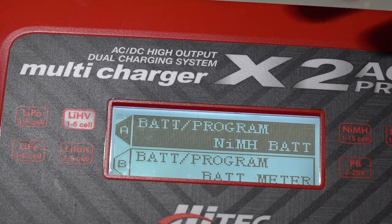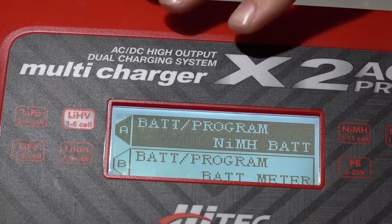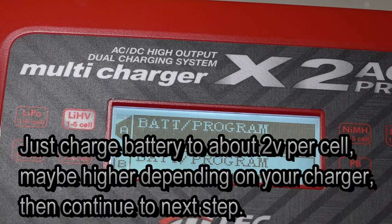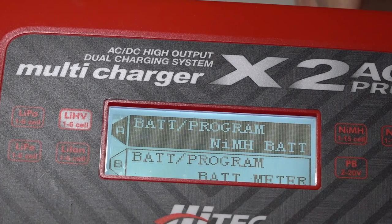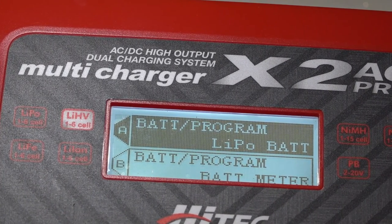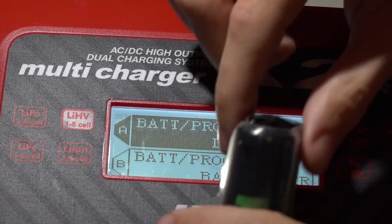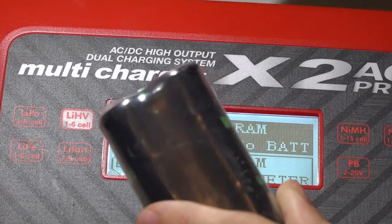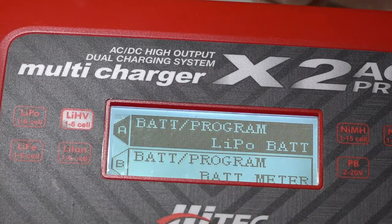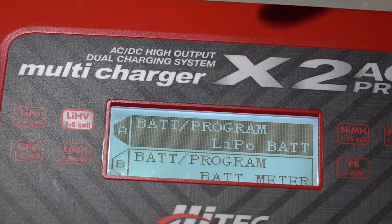It's been about 15 minutes. My battery charger actually stopped at — I want to say it was 5.2 volts, something like that. It didn't make it to 3 volts per cell, and that's fine. So what we want to do now is switch over to LiPo mode, because we should be above that minimum safety threshold. Now, technically, the batteries I'm using for these Fat Shark goggles are lithium-ion batteries, so I will be switching to that — but you will be using LiPo.